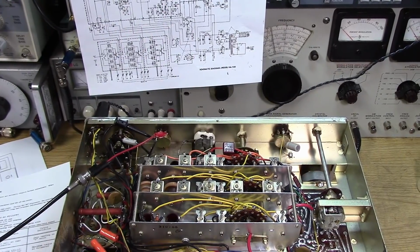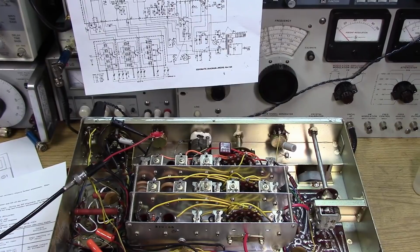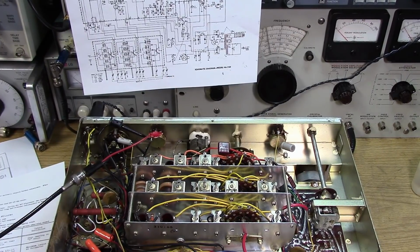Well, I found out what the audio problem was, the low gain, and the problem was me. I'd replaced a resistor, and it turned out that I'd read the resistor wrong because it was one of those charred guys that was covered with the goop. Somehow I interpreted a 470K resistor, a plate resistor, as a 180 ohm resistor.